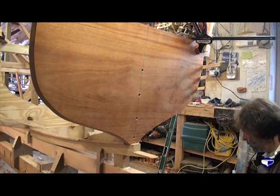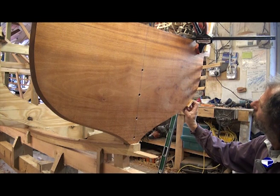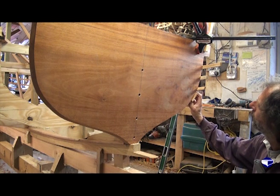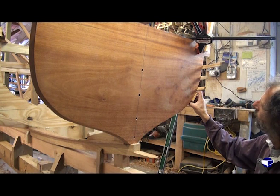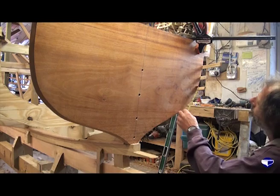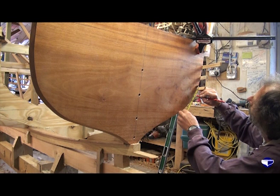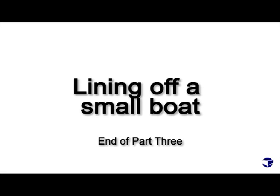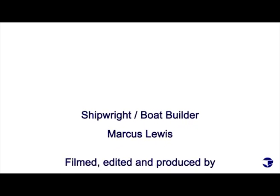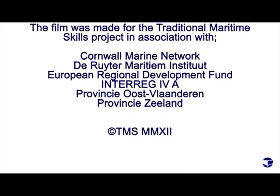If we say the maximum we can really get away with on the most curved part of the transom is two and a half inches — I prefer a little bit less — let's try coming down two and a quarter inches. I'd prefer a little bit more than that, so let's try coming down the other side and see.